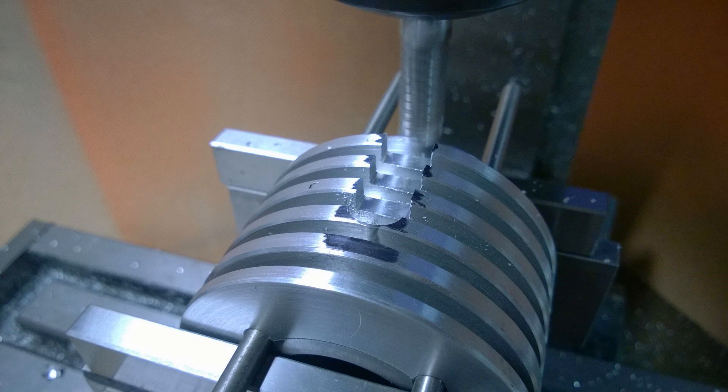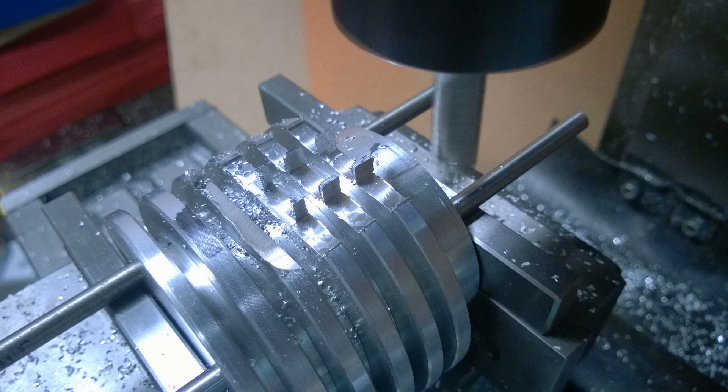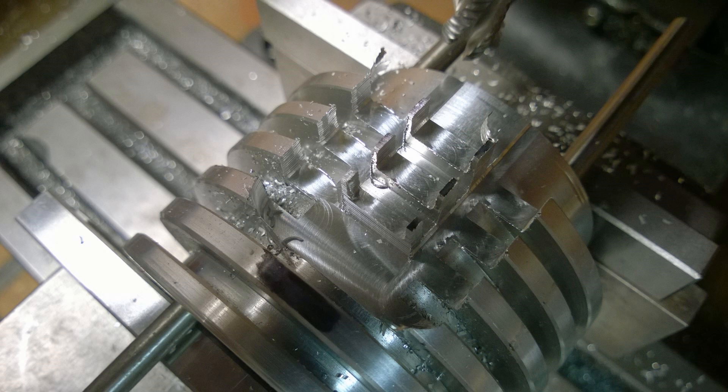The first thing I do is make a pass all the way through at 5mm deep, until I reach where I want to stop, then back out to zero, move along. The whole gap is 32mm wide — that's how wide this relief is, this machined section for the transfer port to sit in. So I go all the way out to 32mm, come in at 5mm depth, cut across and back out again. That leaves a few little unmachined bits which we can clean up later.